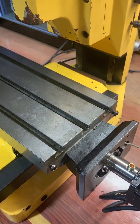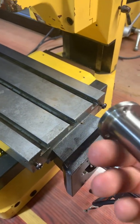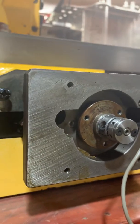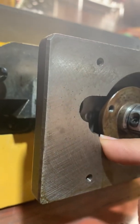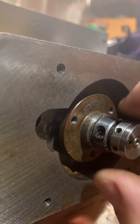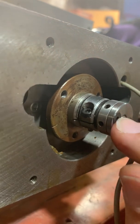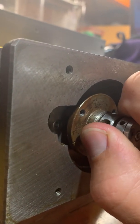The first obstacle is driving them in a direct drive configuration. This part is all original. What we've done is made an adapter that slides over, secures through a grub screw counterbored into the hub. For end float, there's a bearing behind the hub — the hub is split and clamps down onto the shaft — then some nuts to take up the end float and a second nut to lock it. These don't have a ball screw; they have a conventional screw.